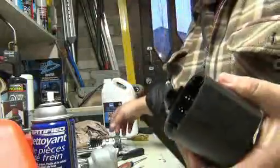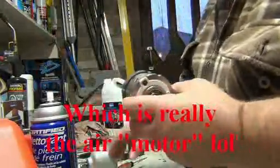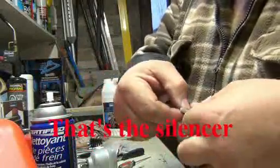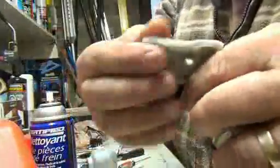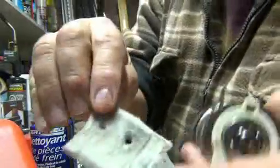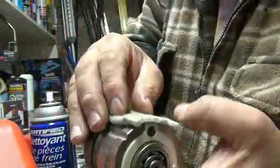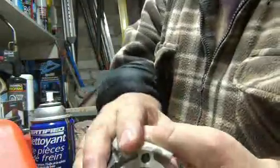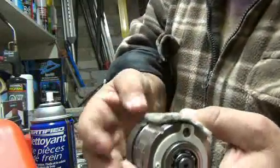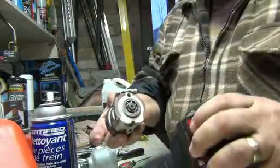After everything is clean, you can take your air housing. Alright. Don't forget to put this back on top. Like I said, I made those holes bigger with the punch. Alright, and if you look at the indentation, you can see that this is the width of that, so you know that it goes this way. Now you line it up as best as you can with the holes on top. Just like that. Make sure the gasket is in the back. Now we're going to put it back in here.